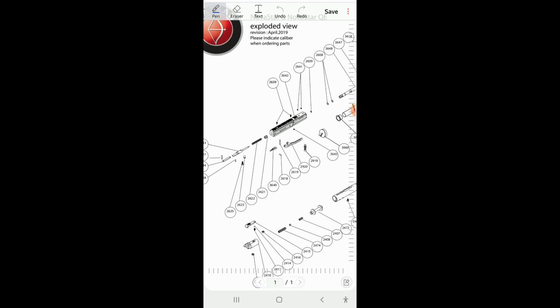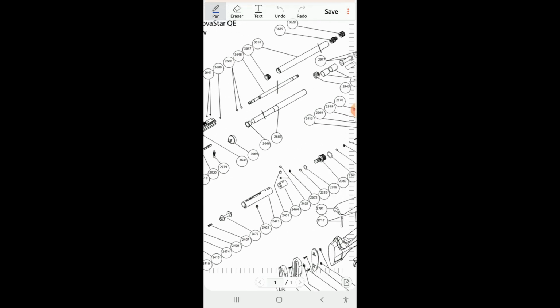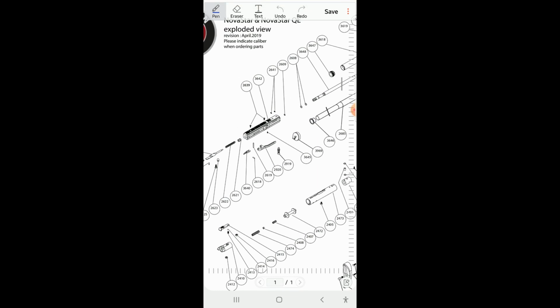And then we re-bent it to how it's supposed to be bent. I think it was bent inaccurately from the factory, so that's why it was rubbing so much, and on top of that, that's why it eventually failed. But so far, after reshaping and repairing it, it lasted 400 shots later, so it seems like it's holding up. So we are ordering that component along with the spring.